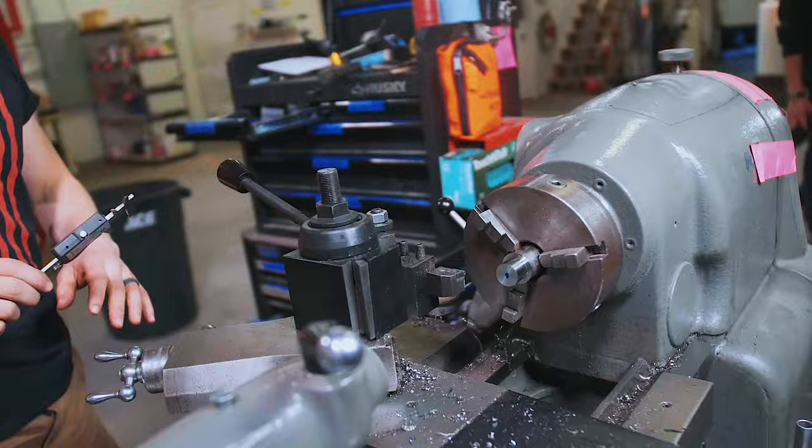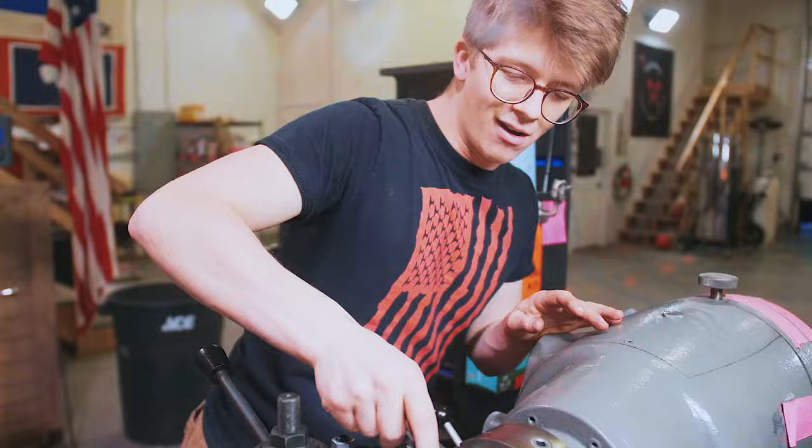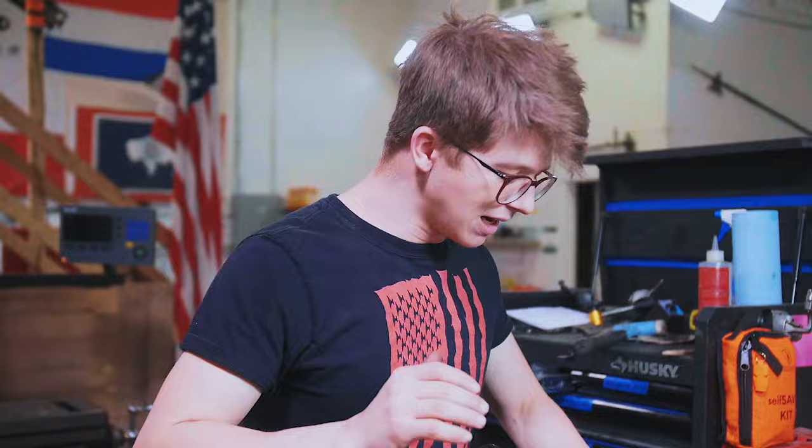We had a CNC milling machine — the perfect tool for this kind of job. We don't have a CNC, but we have a me-NC, and let me tell you, not quite as smart as a computer. So this is going to be a challenge. Now that this requires some serious thinking, I'm going to make this an exact diameter. Right now it is 0.9090 inches — we're going to make it 0.900 inches in diameter, which is about 22.8 millimeters. From there I'm going to open up the computer, draw up this design, and start plotting measurements.